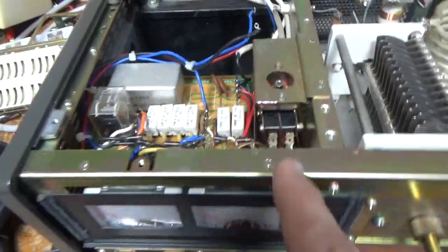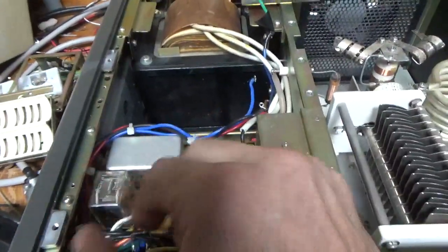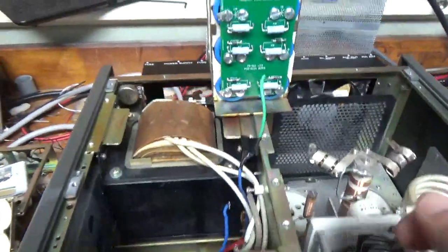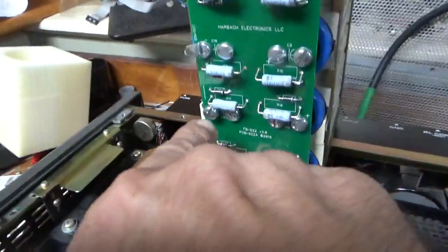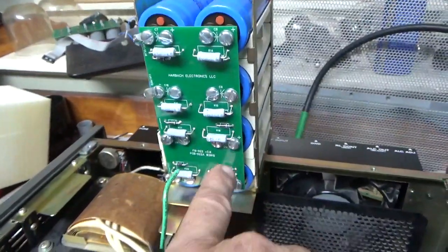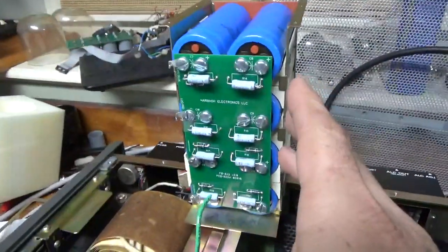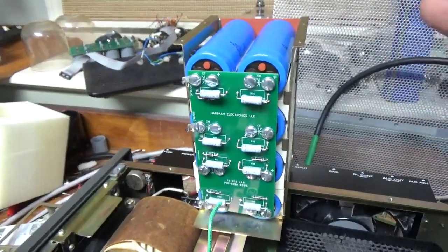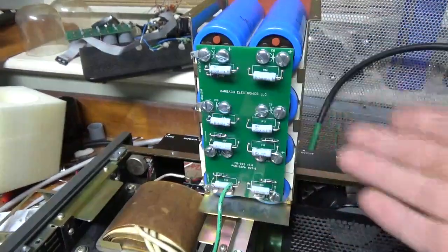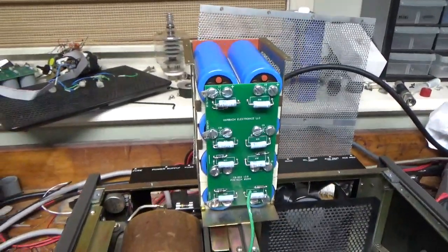The new meters have been installed. The replacement board is installed and everything's soldered really well and zip tied. I've got the filter cap assembly out — you can see the screw that backed out. I'm going to take the board off, check the solder joints in the back, take a measurement of all the resistors to make sure they're all good, then retighten everything and reinstall the caps. When I have to undo something and then redo it, it just ends up taking twice the time.